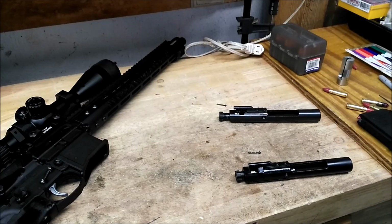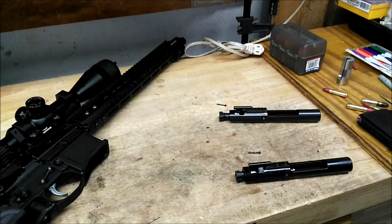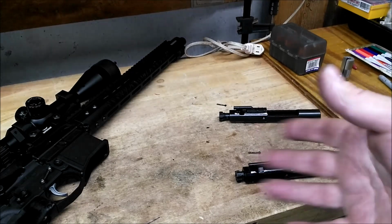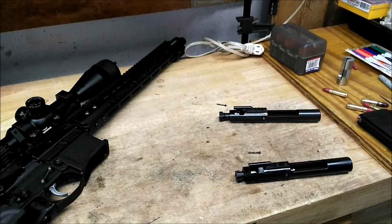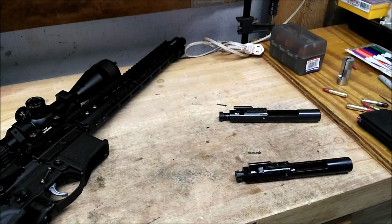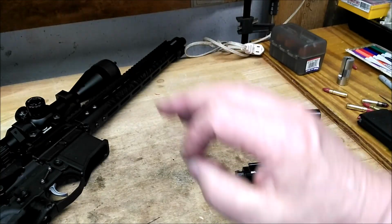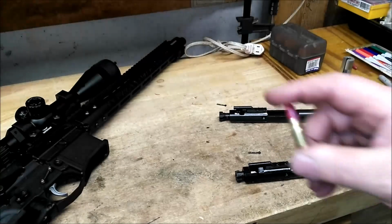All right, well, between that and for some reason my hand loads stick in the chamber sometimes. I'm trying to pull them out with the charging handle. I don't know what the deal is. I resorted to the Lee Factory crimp die. They're all trimmed. I turned the necks. I don't know. Guess I'll have to break out some Lake City brass and make some up. But these are PMCs, and I turned the necks. They're 10,000s. Right back to the shoulder is where I turned them with my K&M kit.